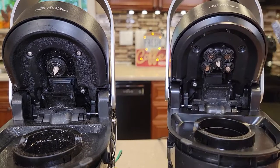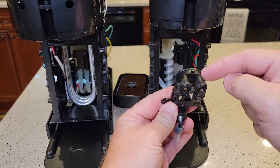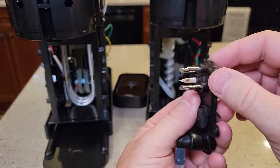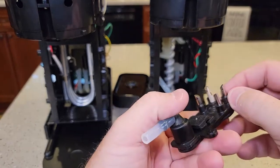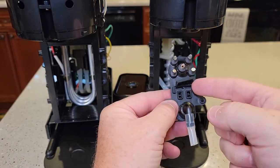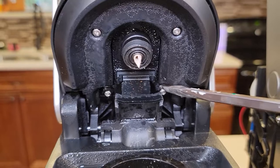So here we've got — this has got the five needles, this has got the single needle. On the Supreme it's got five needles; this is one I took out of another one. It's got the single tube that comes up and water comes out. This is like a manifold — water comes out of all of these needles at the same time. So there you've got the five needles and there's little ports. Obviously the majority of the water comes out the center, but you do have some ports where the water comes out on the sides. Now they all have this little flapper that is held down when it's closed — there's a bracket that holds that flapper down. But when it's up, it just kind of flaps like that. You can see they both have that bracket. When it closes, it holds that down. Here's the single needle, kind of the same deal.